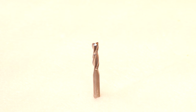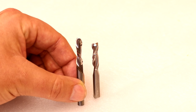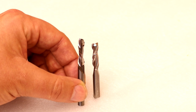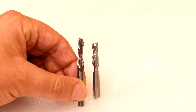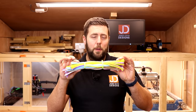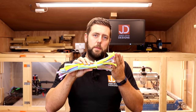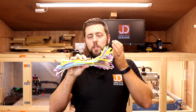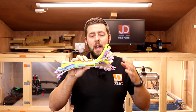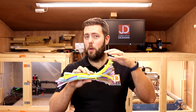What we have going on here is an up cut and a down cut — they are opposite spirals. To explain the difference, I've got a no-expense-spared prop here — just a bunch of pipe cleaners zip tied together. If you imagine the blade on the up cut, as it comes round, it's going to be cutting through the material and pushing all of those fibers upwards, leaving rough edges on top of where it's forcing everything upwards. This will be magnified even more on something like plywood or softwood, where those fibers are a little bit looser — the looser the fibers, the rougher the finish.